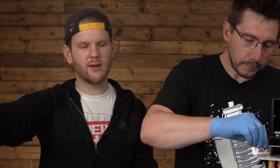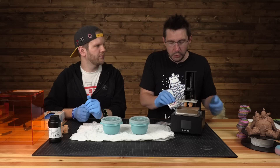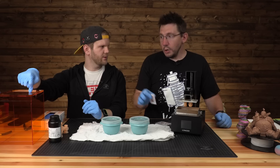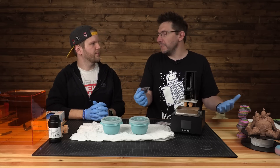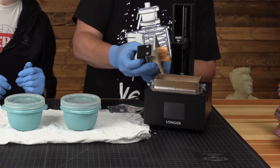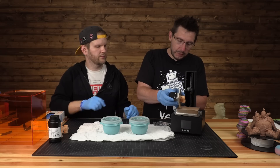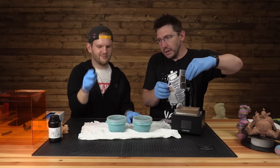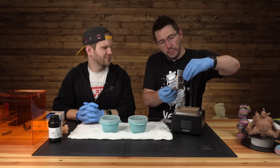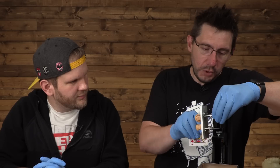A question about resin printing: is it okay to have the top off for a while — will the resin cure just sitting in open air? The resin cures by UV, so if it's near any light source that emits UV, it will cure. Generally you don't want to do this in the sun. The orange cover protects from the 405 nanometer wavelength UV that cures this resin. There's quite a lot of uncured resin dripping since everything prints upside down. Machines like the Prusa SL1 and Formlabs have their own built-in washing and curing stations so you don't have to do this manually — but they cost way more, so you're paying for convenience.